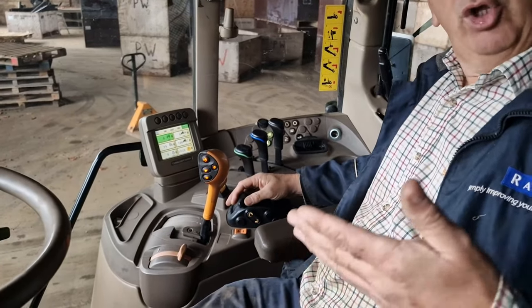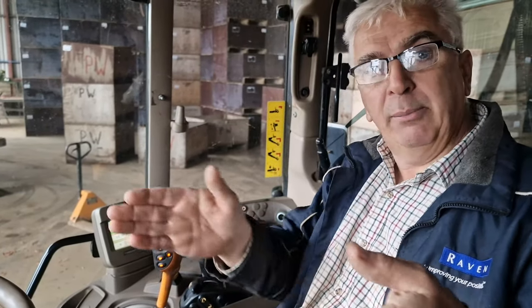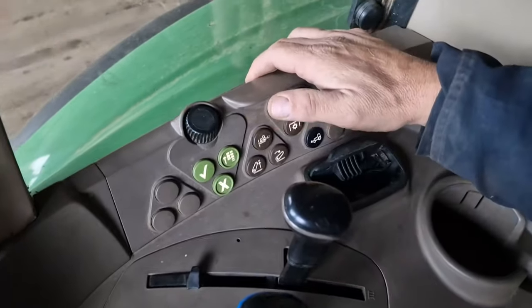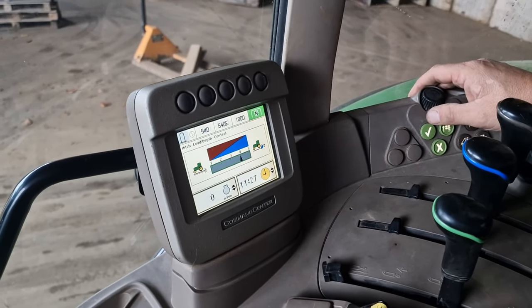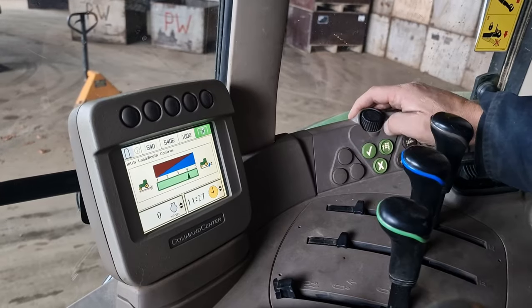As I understand it, this is what they call a mixed system. This does your arms control - your up and down. You can adjust the draft control by mixing it from a position sensor to a draft sensor, and you can adjust it all the way in between, depending on what job you're doing. So you don't always need full draft - you can mix it a bit. On this tractor you go into your menus, press that button there, and it brings up the setting. It's showing a mixed system and you're on position four. On a plough you want to be fours to fives. Once you've got that set, you shouldn't really need to adjust it much during the day.